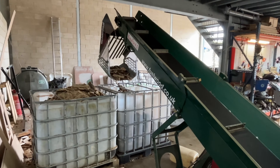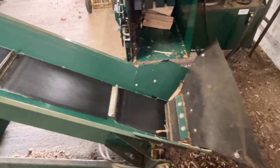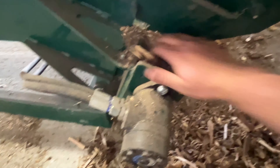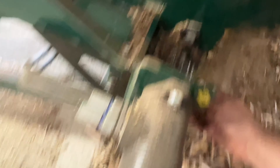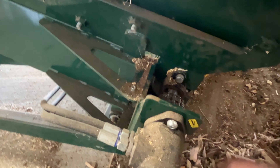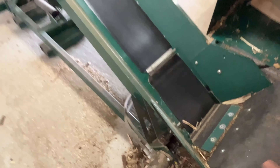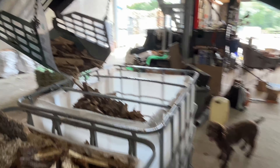The elevator pro is a great elevator but it could be better - you get quite a few bits dropping down through here. I believe a few people were working on a new elevator, not too sure. There's normally a cover over here where the motor connects - there's just a chain that connects the two together on two kind of sprockets. I took this cover off because I never come around here when it's working. I do like to get to this grease point and keep that clear - it's quite hard to do with the cover on, and it does build up with quite a lot of waste in here.